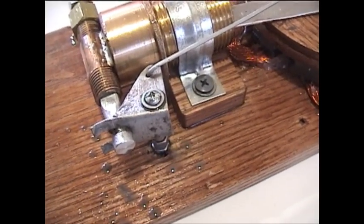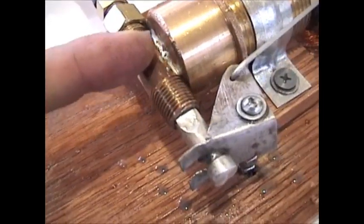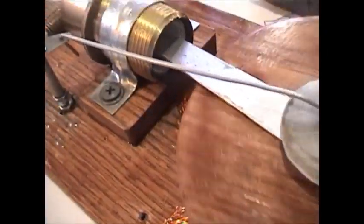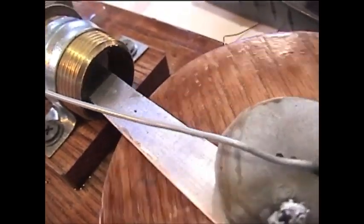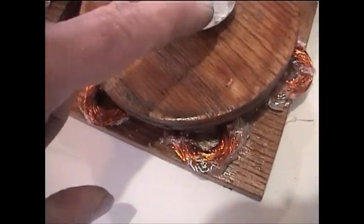So, it's an interesting little motor. There's a port right there that goes through the head into the cylinder. I'll have to try it with steam. I'm using a little PVC three-quarter inch cap in there for a piston — it's a nice fit. And that was kind of my creation.